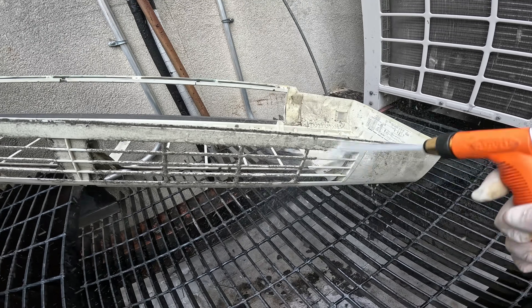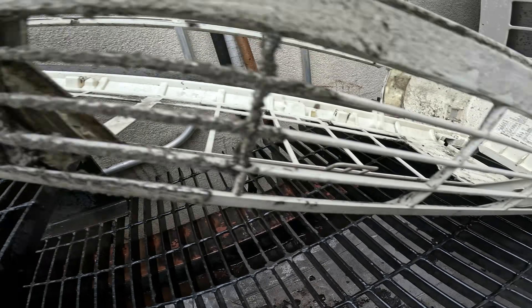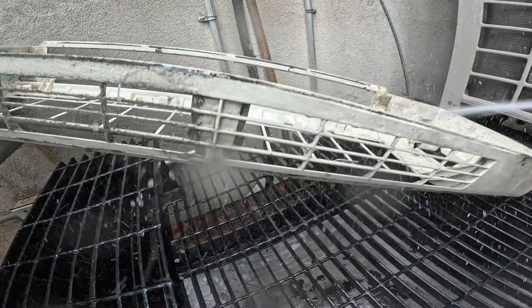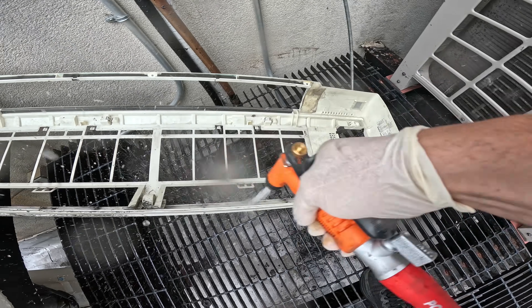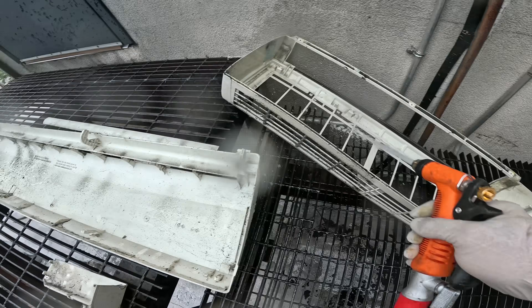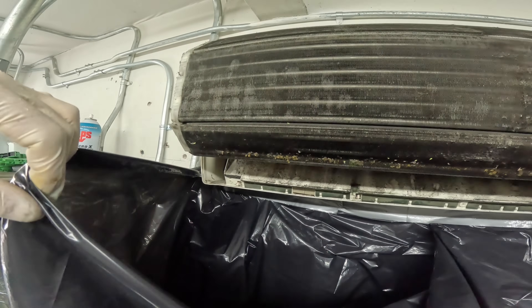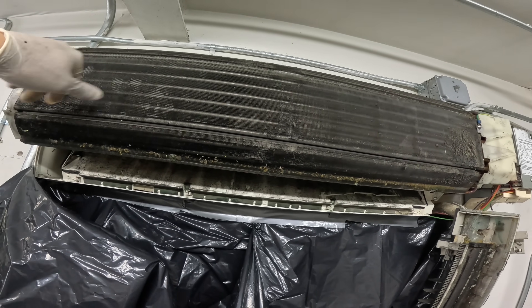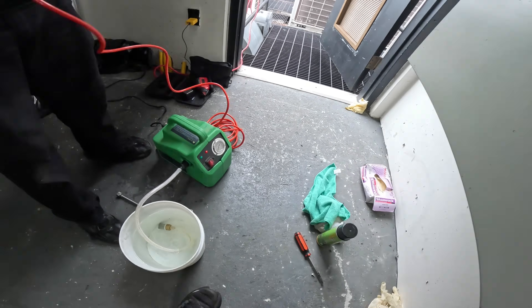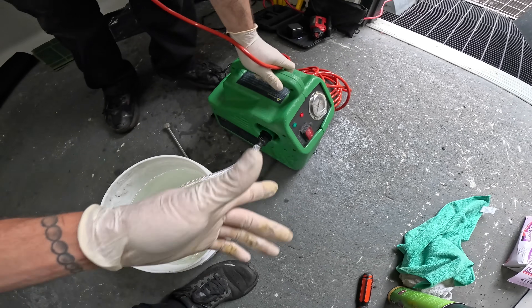You can't forget about the outside covers — put it down, wipe it down. I know this looks a little crazy — they sell a thing for this — but put a couple garbage bags, two garbage bags with some duct tape, while you hit the coil, just to hold it back. First we're going to brush it down and then hit it with a little pressure washer. Got this little tool right here — a subcoat water blaster. If you don't have a constant water supply, just use a bucket, but you do need a power source.